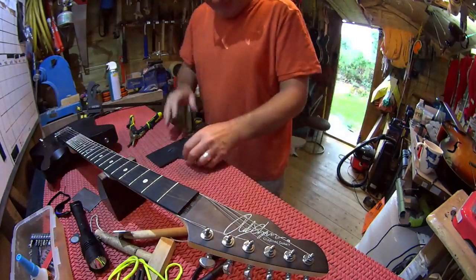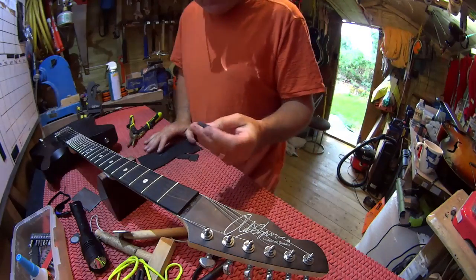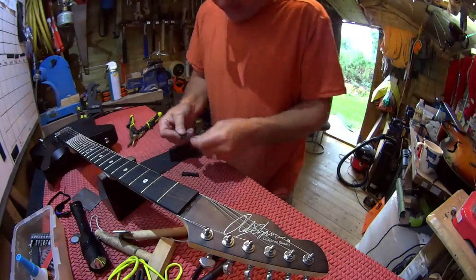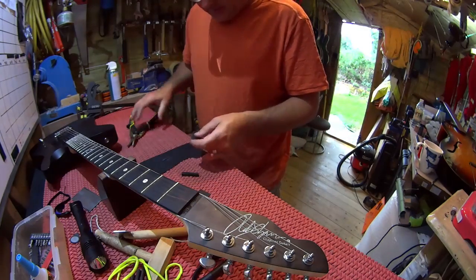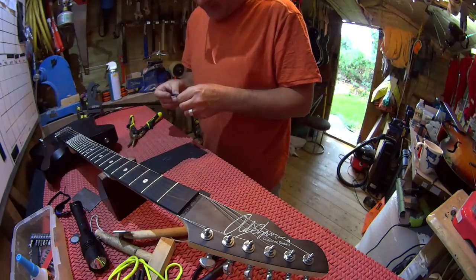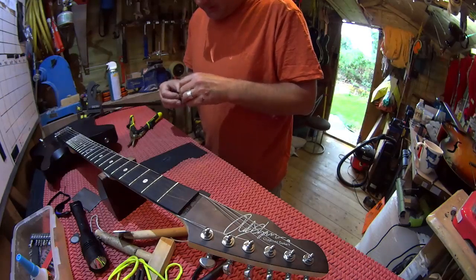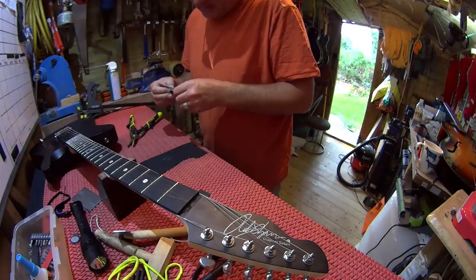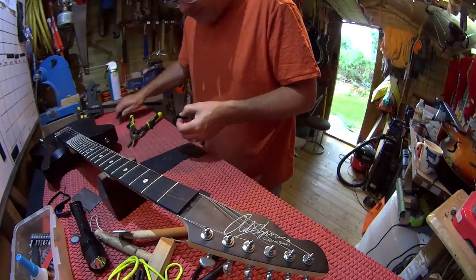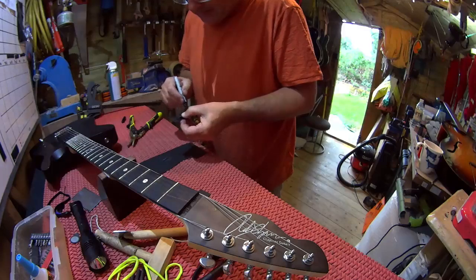Okay, so spare nut. This isn't going to be any good to use, so I could shim it as well, and you can have that back as a spare, because it's always going to be too short, too low, for that guitar. Stick it, might as well, I can do a spare one and file it as a single job. Okay, so I'm just going to draw around it again and cut to the inside of the marker pen.